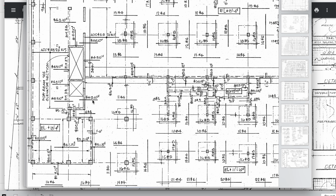There's a planter box here also added. It looks like it presents a planter box, and you got the weight room here, exercise room, and a doorway here. So the doorway there means more loading across the header down to each side of the doorway. I believe there's a doorway here also. So again, more focused, concentrated loads on each side of the doorway. Doorway having a header and some block above it, going to focus its loading on each side of the transfer slab, the L shape.